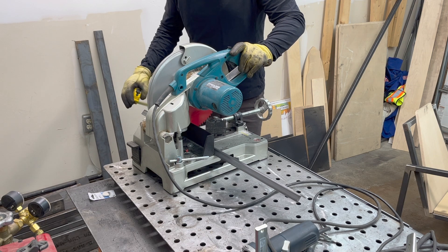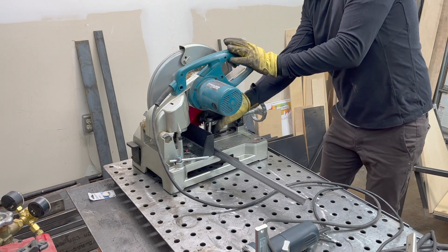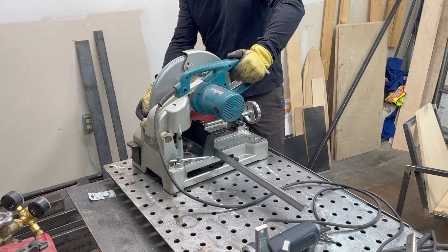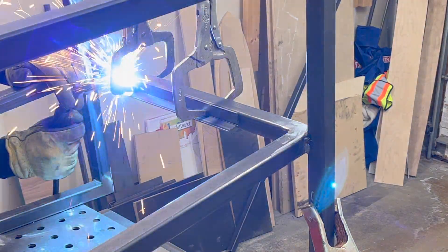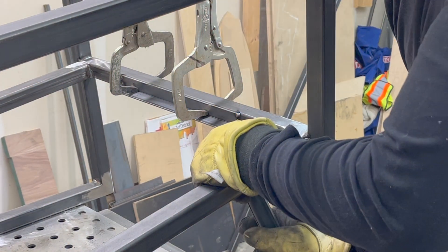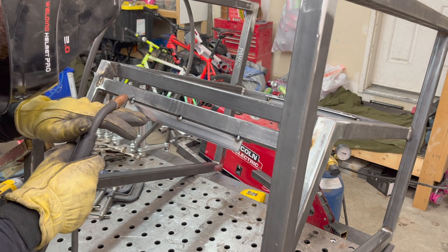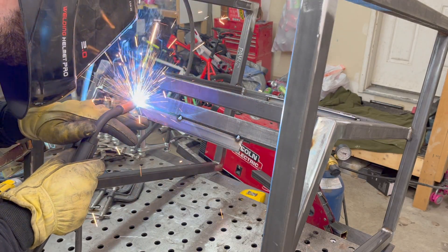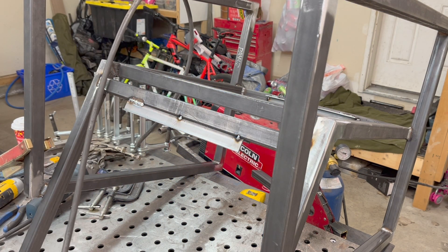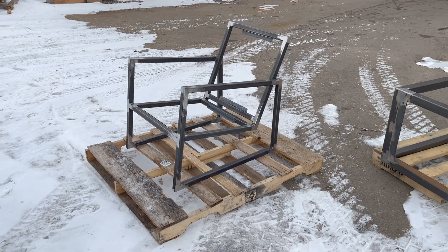The last steel work I needed to do with the chair is to cut some angle iron that will be welded on the seat and the back. This is what will hold the walnut bottom and back in place. Once I cut these pieces, I weld them onto the frame and then grind down the welds so that everything is seamless. I spread out the welds on the back piece to avoid warping or overheating from such a long weld. Finally, with all of the welding done, I dropped the frame off at Impact Coatings here in Edmonton to be powder coated a nice matte black.